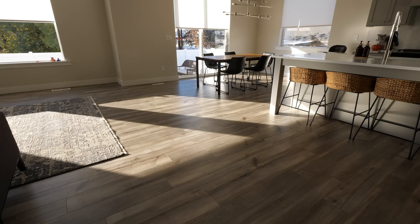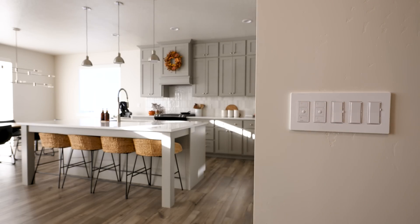To set different levels, go into the Lutron app, set all shades exactly where you want them, and hold down the button on the Pico remote to save that preset. The translucent fabric allows plenty of light into the room while blocking the full brightness of the sun — it works really well. Even with all the roller shades operating at once, you could barely hear any sound, and they move very quickly. If you have the chance to pre-wire your new home for Serena Smart Shades and the power panel, I 100% recommend it — it's a fully integrated, very professional-looking, low-maintenance system.